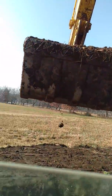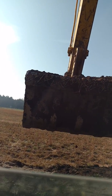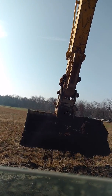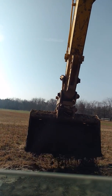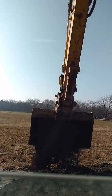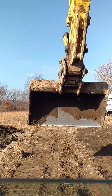The other thing with these mound systems — you don't want your topsoil to be real heavy clay. These mound systems are meant for some of the water to evaporate instead of soaking down through the sand and into the ground. So if you use a real heavy clay topsoil, you're not going to get the evaporation out of it that you need.